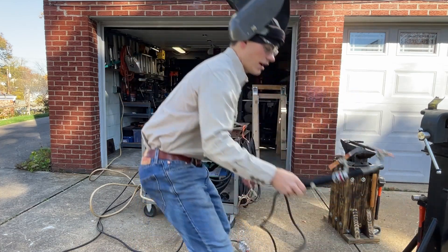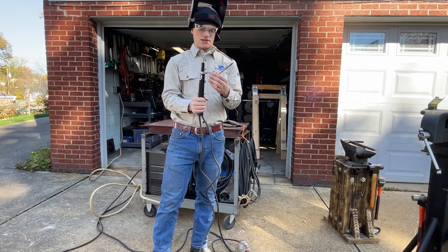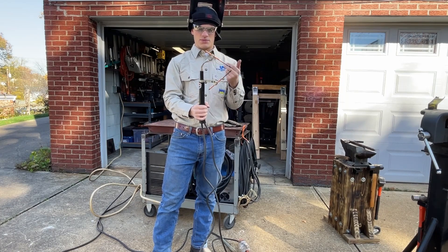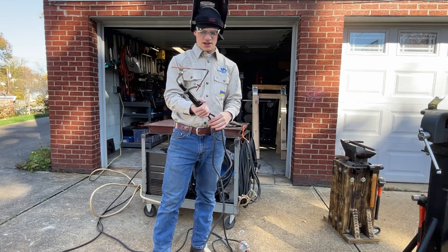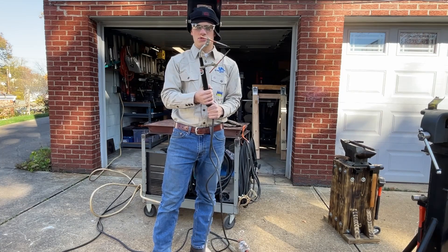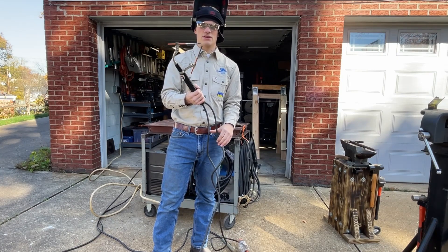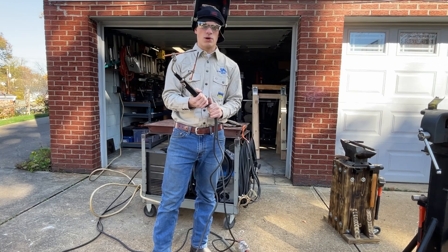Going above 3/8 inch comes into question in terms of how much your torch can handle. This torch has thin crimped steel ends and the cables are not super heavy duty welding cables rated at 200 amps or anything like that. So you just don't want to push it — I wouldn't really go above 100 amps, especially for anything home hobby use.